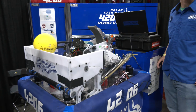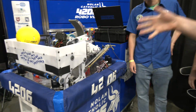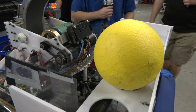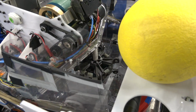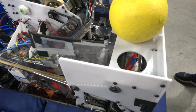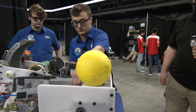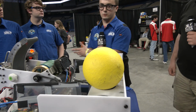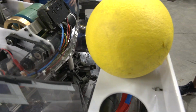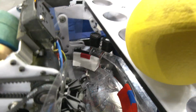Let's move on to Graham, who is going to be talking about the Spindexer inside your robot. So we'll go into that, talk about what makes it work, some of the thought process behind that as well. Starting off with the Spindexer, we had to go through many prototypes to get this working. It's combining having many balls in there, yet maintaining space and inventory on them while also being able to shoot correctly. So first we have the main spinning wheel. That's the indexing part of the Spindexer with our spokes, which we made out of clear polycarb, so our drivers could see if there's any jams or anything like that, which was a major point of our prototyping process.